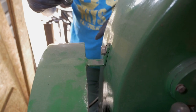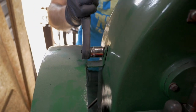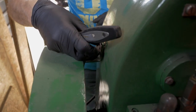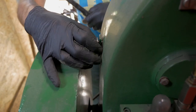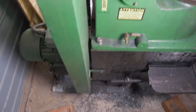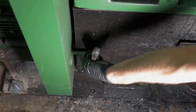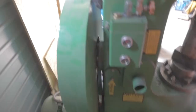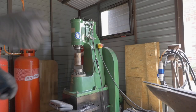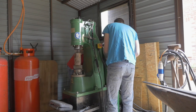There are three bolts — a bolt at the top and a bolt on both sides. We're going to undo these bolts, take them out, and lift the cover completely off. That means we can actually get to the stuff underneath and give it a good grease. I think it lifts straight up, though it's going to be heavy.